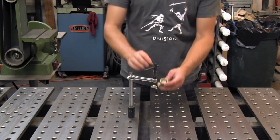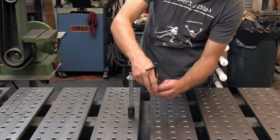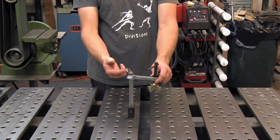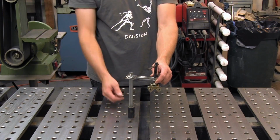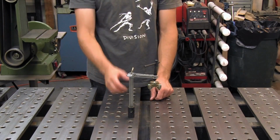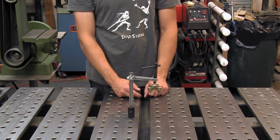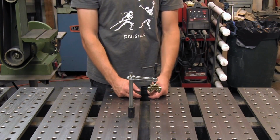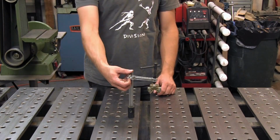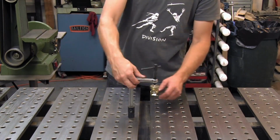These are the Inserta clamps, which can also accept a V-pad to clamp tubing. They also have a little split ring on the top that prevents the two pieces from coming apart, but I actually flip them over like that so that the clamp doesn't fall back down on the workpiece that I'm welding when I'm changing positions. So it's kind of a little trick.